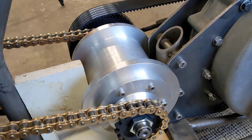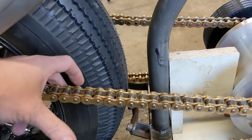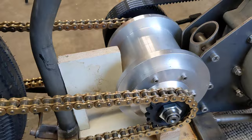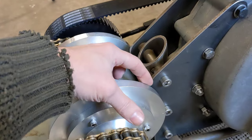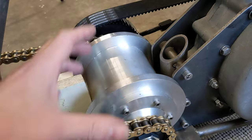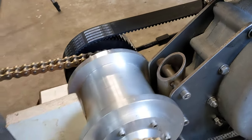I wanted to make sure that with the mudguard removed there's enough clearance for the tire on either side, and that all of the runs are as straight as I can get them. I'll then precisely measure the thickness on either side because the gearbox is slightly offset, just to get that belt as absolutely straight as I can get it.